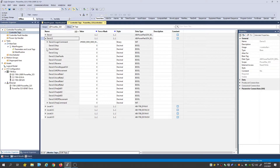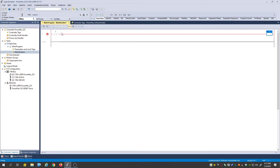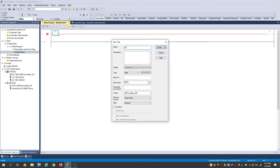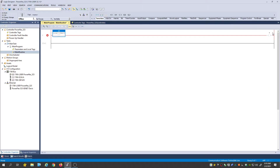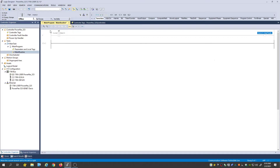One of the ones we're going to use is the start command, and another one is clear faults. When you're using clear faults, you just need a button that would actually clear the fault — because every time you do a communications download and connect to it, it'll throw a fault, and you need to reset that. So I'll use a switch — I'll call it S3, which is an alias for local input zero. Hit Create. On my output, I'll find Clear Faults under my Davis tag and map it there. Right off the bat, if I need to clear my faults, I'll just press S3.